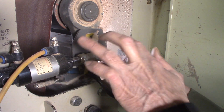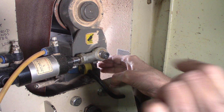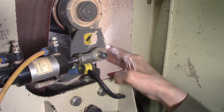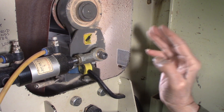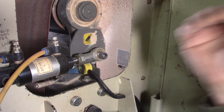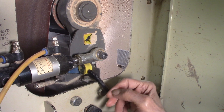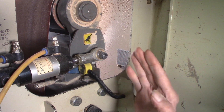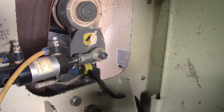This is the top roller carrier — that shift causes the belt to move that way. Once it moves a little bit, the light comes back on and it switches back. Because the belt can be stretched on one side, anything can happen, so they have to have a control that accommodates these variables — and this is it. The belt just sits there going back and forth, making a little ticking sound. You can hear that happening while it's running.